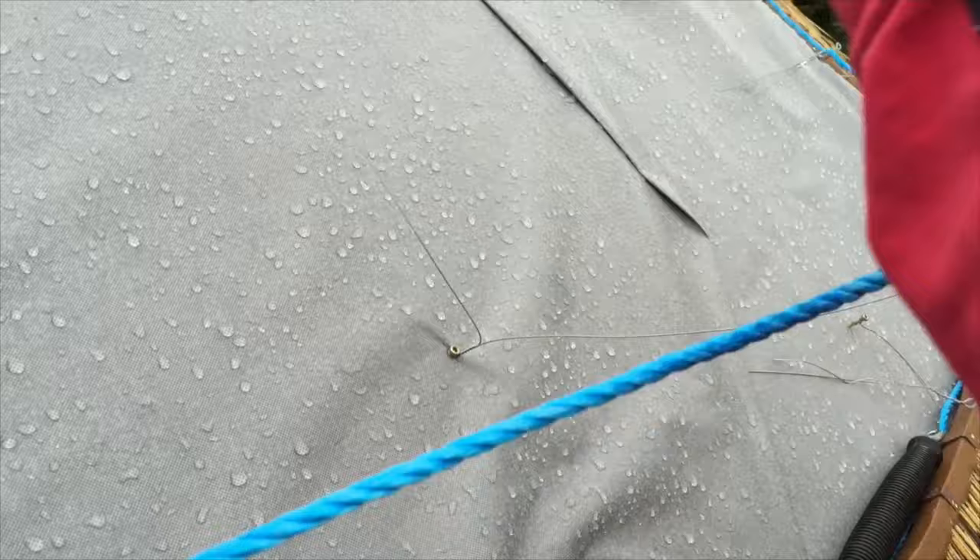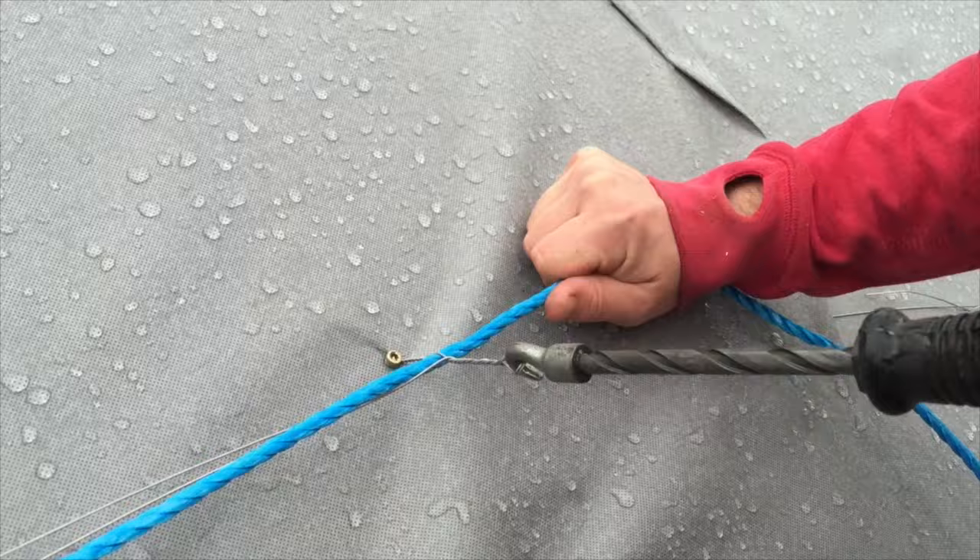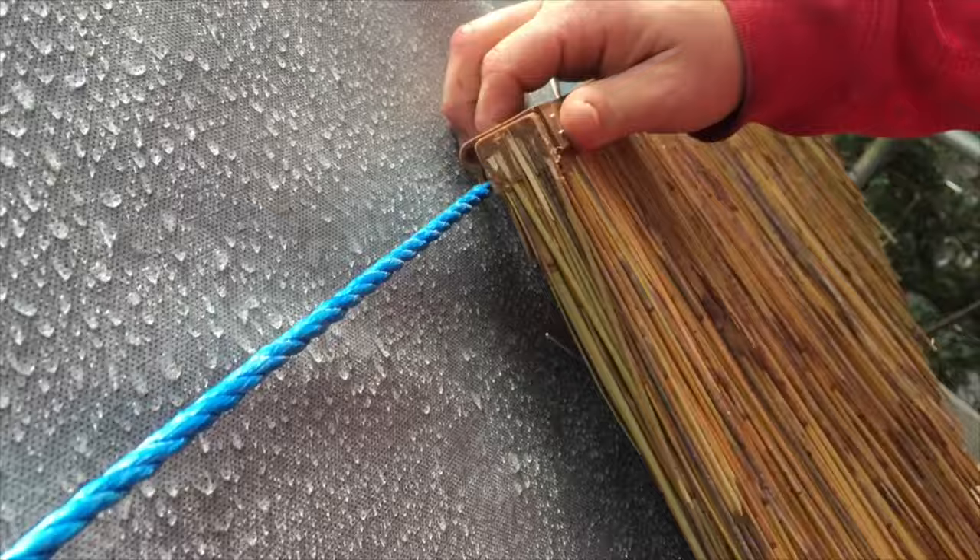If your roof is boarded, you may choose to screw directly into the boarding and use rope to hang your tiles from. 8mm poly rope is the best as it won't degrade under the tiles and is cheap to buy. The tiles simply clip to the rope in the same way that they clip to the metal bar.